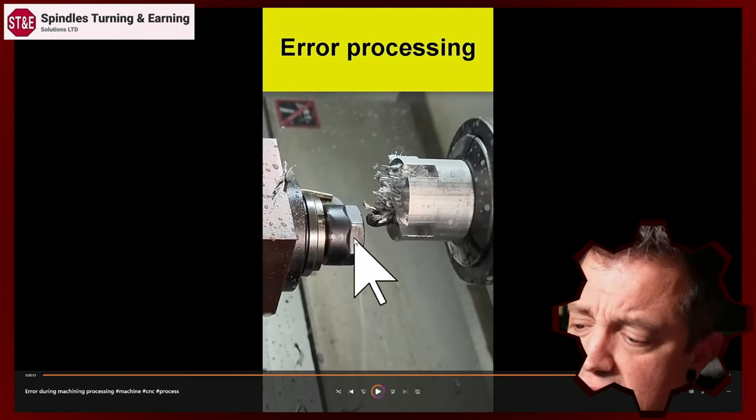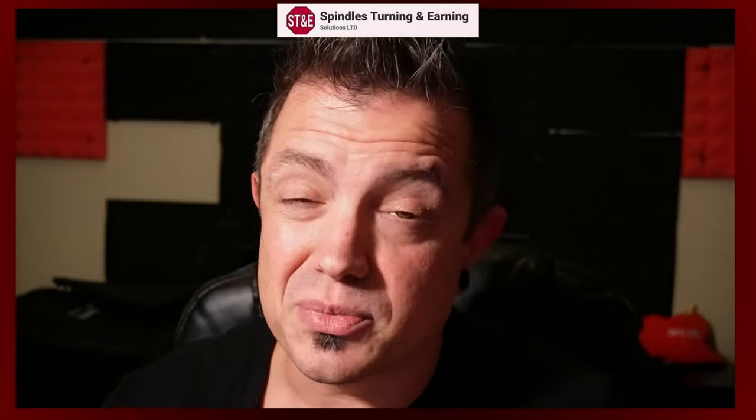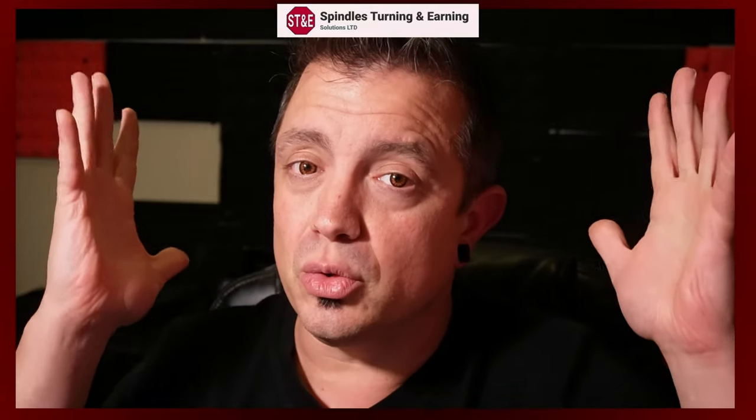Now, what do you do if you get into this situation? Great question. The first thing you need to look at is the style of end mill that you're using. If you're using something that's a general purpose end mill and you're going that hard and fast in aluminum, you're gonna have problems with chip evacuation because it's just not made for the aggressive cut. There's not enough room in the flutes. It's going to impact, it's going to explode.